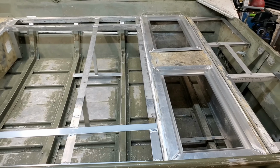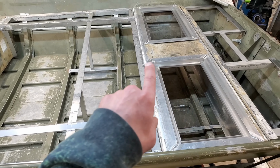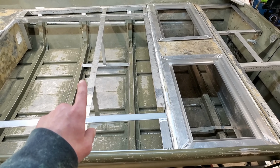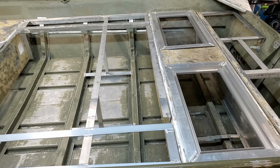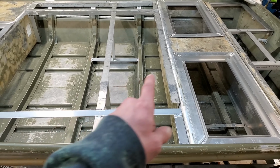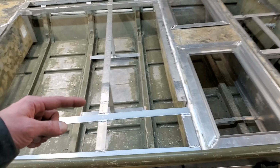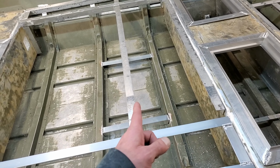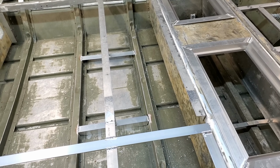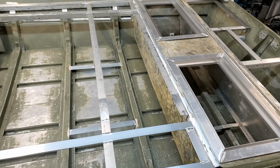And with that being said, you don't have to sit on this bench and reach back and grab a tiller arm. So we were able to extend this back bench seat forward, which I've never been able to do. Most of my builds, you need to have accessibility to the tiller arm, not with this one. So what we did is we extended this 16 inches forward. This is gonna allow him a tackle storage space that's 16 inches wide by about 48 inches in the floor. You could probably fit 30 Plano boxes in here and still have room. It's gonna be pretty cool when it's all done.